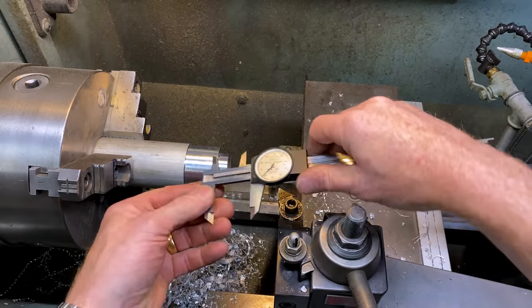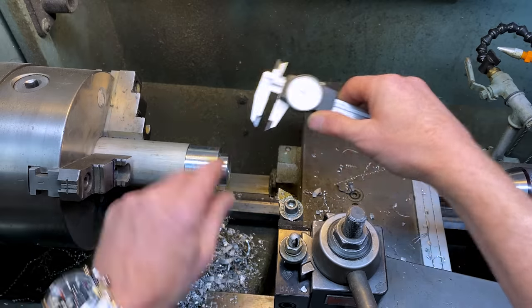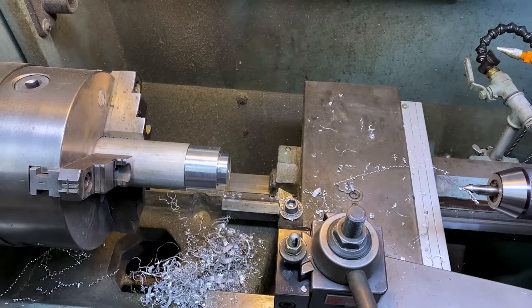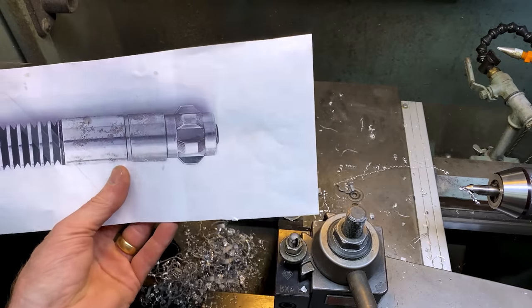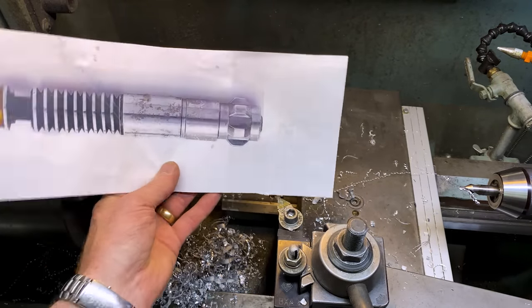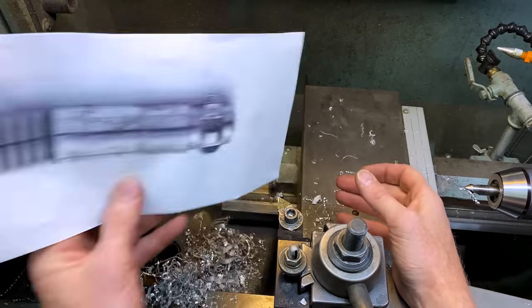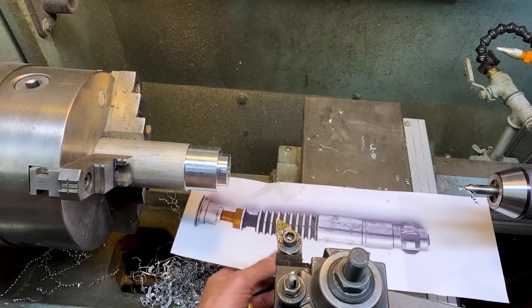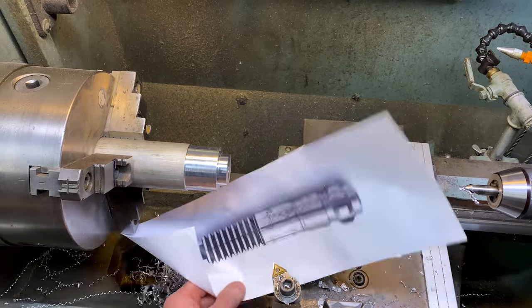That's 4/10 of an inch deep. That is 1.375 in diameter. Now what we have here is these angles. So what are these angles? This is one of the reasons I love these specific Aloris Universal bits, because I can use them to set angles that I want. And I do this pretty much visually. I know that's not necessarily the exact right way to do it, but what the hell. It works for this kind of stuff.